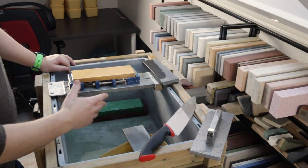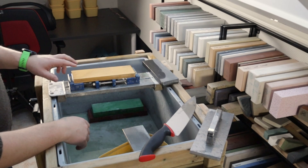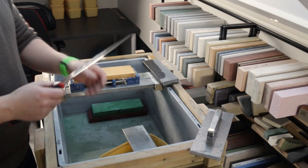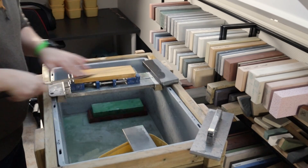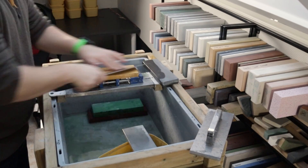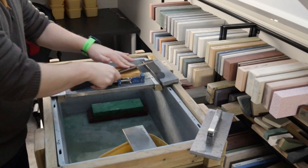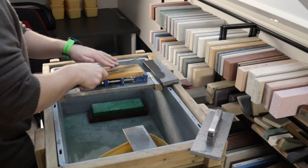When you're moving on to other grits — say you want something finer than 1000 grit after this — the Shapton Pro would be a very good stepping stone for that. It's also a very good stone for general maintenance for people who don't necessarily want to go any coarser. You can see when I'm working on this, it's removing quite a bit of metal, and it also grips the knife pretty well — the whole table is shaking.